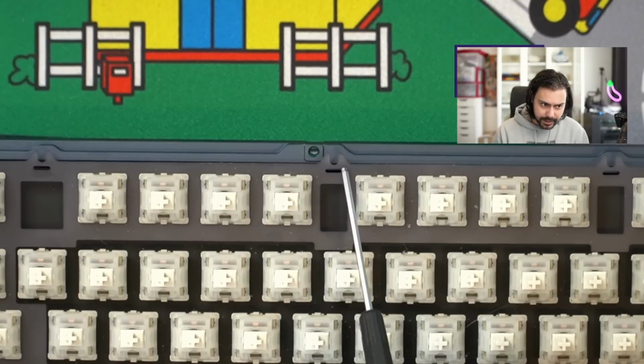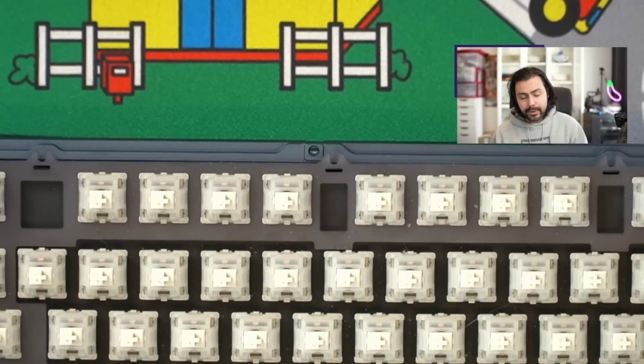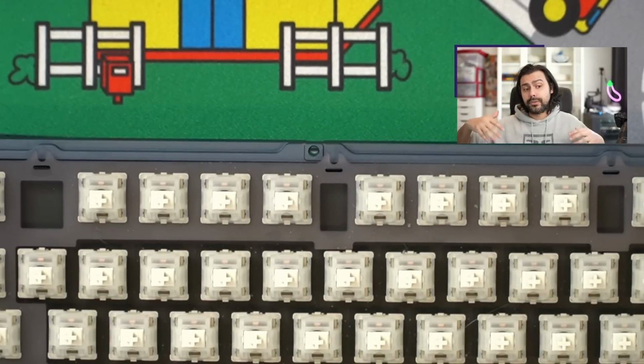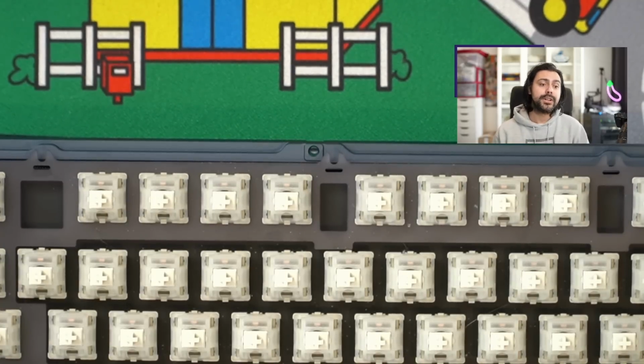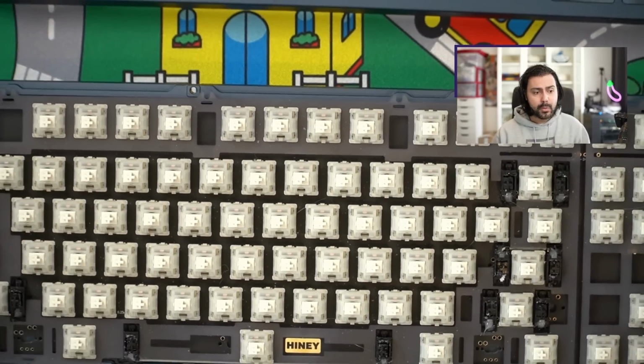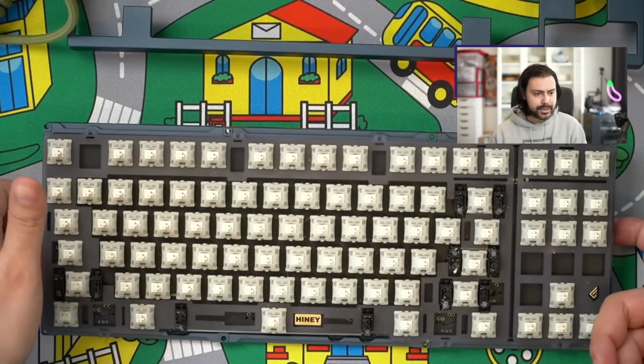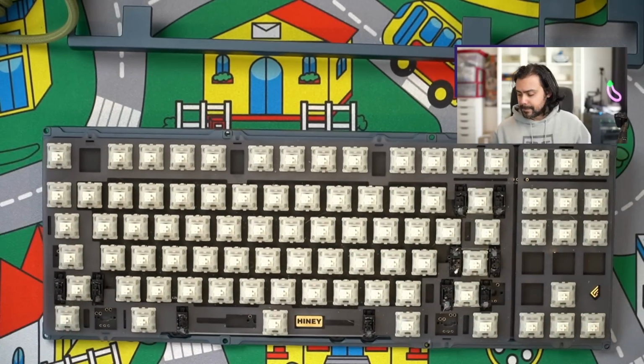And then having this cut right here will also do the same. So it allows you to have a relatively firm mount to the actual case, but when you press the plate incredibly hard, you'll get a little bit of flex out of it that you otherwise wouldn't really get. You'd kind of get deformation instead of flex. Now, this came with an aluminum plate standard, and my particular version here has a polycarbonate half plate.